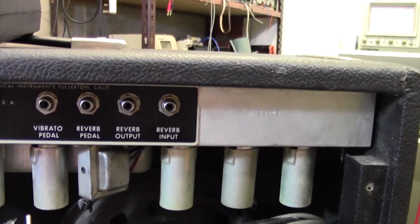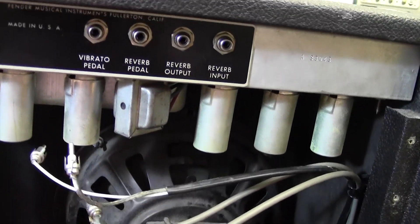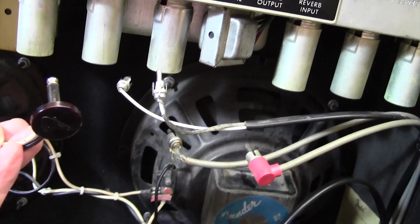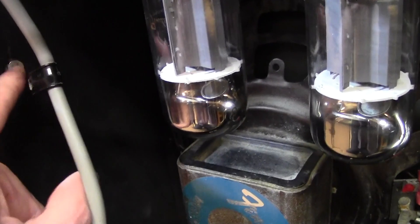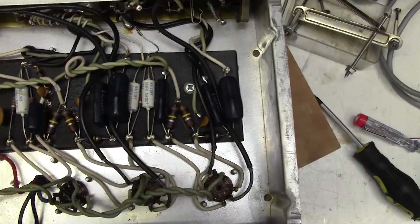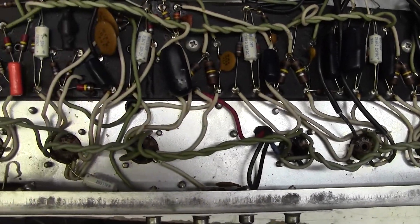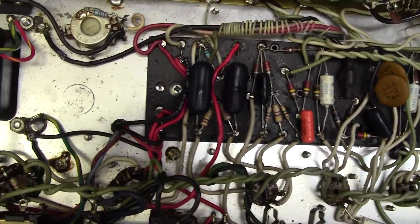You probably don't need me to tell you this, but in order to get the chassis out you have to disconnect these plugs and sockets — I always make a note of where they came from. Take out the speaker lead, which is this one here, and also undo this cable tie. I always put the screw back in the hole. Now I can take the chassis out by undoing these and these. Okay, let's have a look under this amp here — a quick scan along. I'm noticing a few things here; we'll do a scan first and then I'll come back to it.